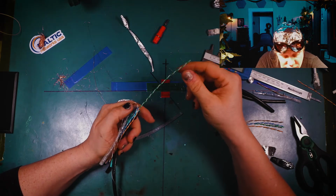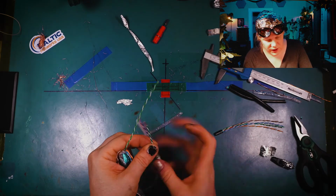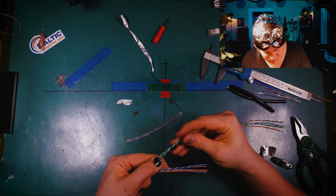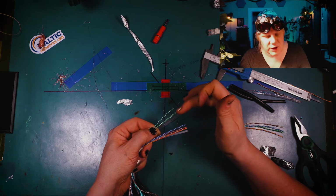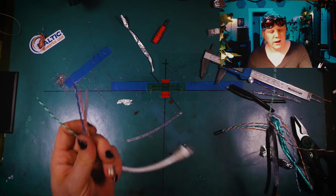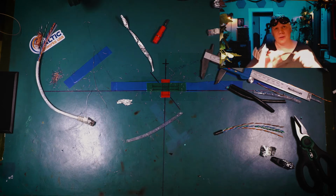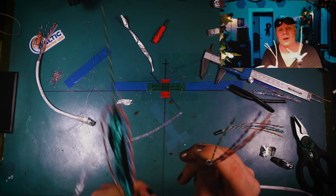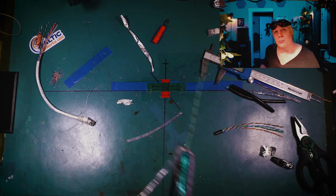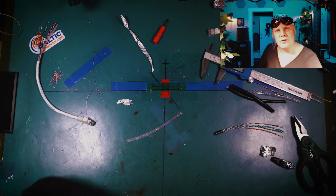Isn't that interesting? So now, if we compare this to the Cat6, you will actually see it's almost as many twists per inch on this outdoor Cat5e as there are on this good quality indoor Cat6. Nearly identical. So this stuff here, this Cat5e outdoor, is actually, technically, you could qualify it as Cat6. The differences here, right? And that's probably why the tough cable carrier works so well. So there you go. It's good to take a look at some different cables tonight.